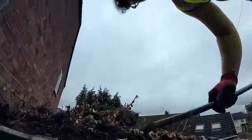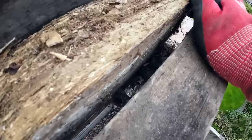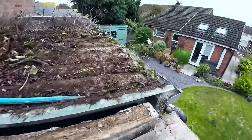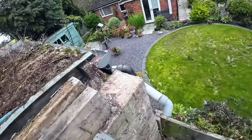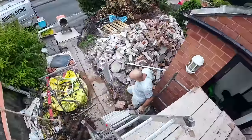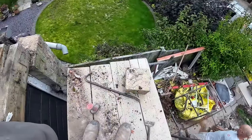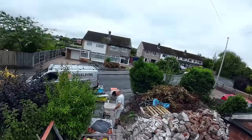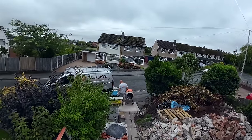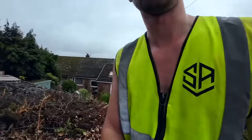Do you think that's held together with just one big nail? It's held together with one nail. And there it is. And shown the corner of the pillar that's come down. Oh yeah, and all this just came off. It was already loose. All shaking. But it's very, very weak. Probably lime mortar that. So I'm going to clean that off. Probably get the recipro saw on this nail because I can't get proper leverage to get it out. The thing that does the cutting. So I'll get you set up while I do that, and then Dad's going to go pick up the steel, I think.